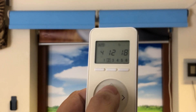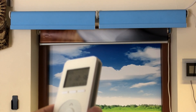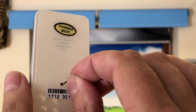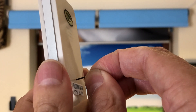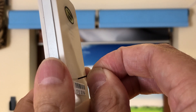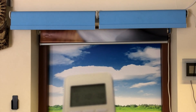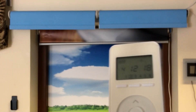For the purpose of this video I'm going to say that position is acceptable. To lock it in at the top position, we go back to the program button on the back of the handset, press it until it clicks keeping it pressed, and then we get a response back from the motor. Now that limit is locked in. Because we haven't set both limits yet, we're still in dead man's mode.